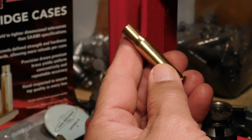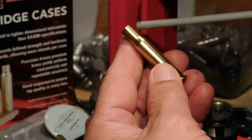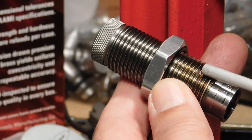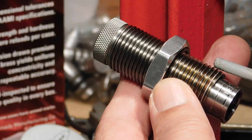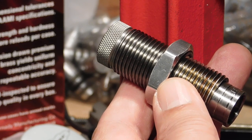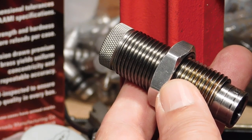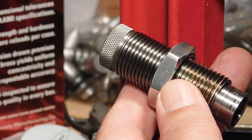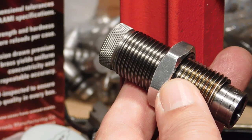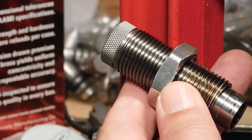Now, if you reload enough rounds, you will actually experience that buckling or bulging that will happen in crimping procedures. So how do we know when everything is going according to design parameters? When we use this die, the loaded round goes in and we don't feel any wholesale resizing like we're trying to full-length resize the case — we only feel a momentary pressure hesitation, and that's the bulges being ironed out. When that happens, we know that round is going to function and feed into the chamber very well, and the bullet retention from the crimp and the neck tension is fully in play.